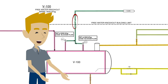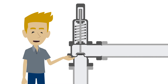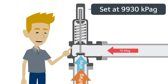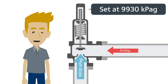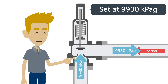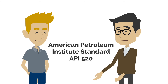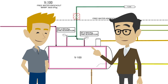We do have a check valve on the common outlet of the PSVs, which could potentially freeze. Also, depending on the design of the PSV, back pressure on a PSV could prevent it from lifting at the required setpoint. If a PSV is set at 9930 kPaG but has 70 kPaG of back pressure on the discharge side, it may not lift until the suction side reaches 10,000 kPaG, preventing the valve from effectively protecting against overpressure. Even if the valve does lift at its proper setpoint of 9930 kPaG, it might not be able to relieve enough flow with 70 kPaG of back pressure. The American Petroleum Institute standard API 520 does not allow for check valves on relief lines. We should make a recommendation to ensure that the check valve is removed before we can take credit for the PSVs.